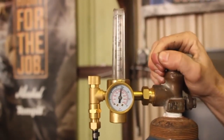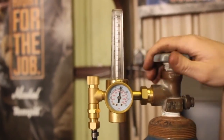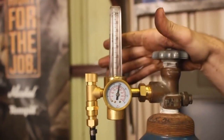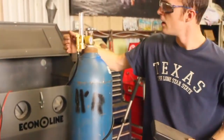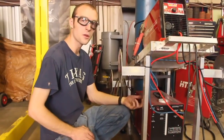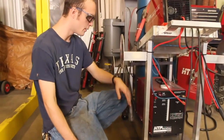We'll just open up our cylinder of Argon here — brand new cylinder, a little over 2000 PSI. I'll open it until it stops so we have that nice seal on the bottle. Then I'm going to come over here and grab our foot pedal, get a little pre-flow action going, make sure this is in TIG mode first — it's really easy to bump between modes. I'm going to set this to about 25 CFH or so.